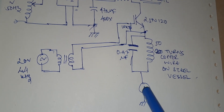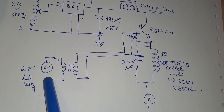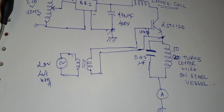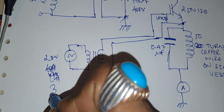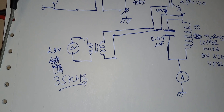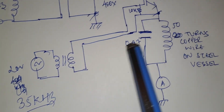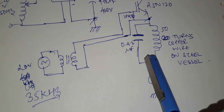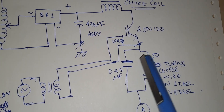The circuit output passes through an ammeter and connects to circuit ground. In this video I am feeding 20 volts at 35 kilohertz. The frequency has changed since I increased the number of turns. At 35 kilohertz, the voltage across the inductor is at maximum — that is the resonant frequency of this LC pair.